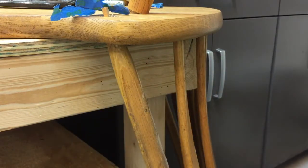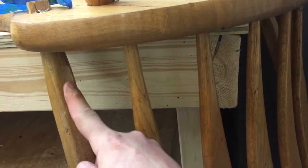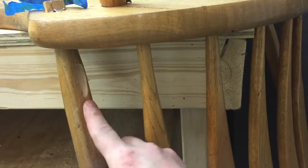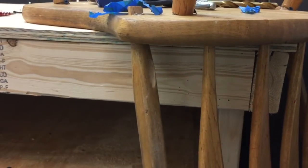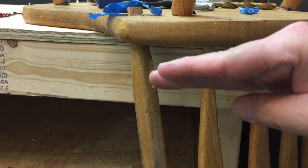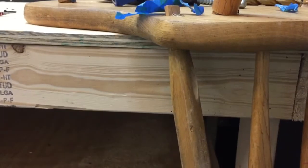Here's a better view of what's going on. You can see there's that pocket hole, which is actually made to accommodate a screw to go up through here. I could put a screw, but I think I'd feel better about it if I were to drill this out some more and drive a dowel through here with a lot of epoxy to really make it strong. When you have a cracked piece of wood like that, you want to go as close to a 90-degree angle as you can through it.